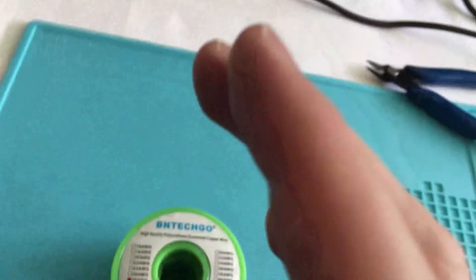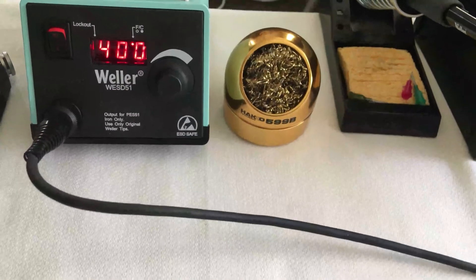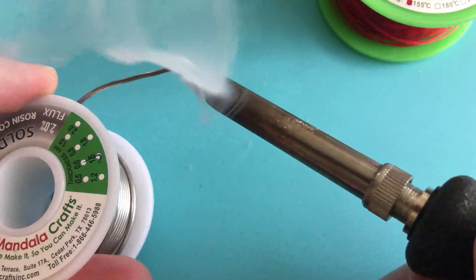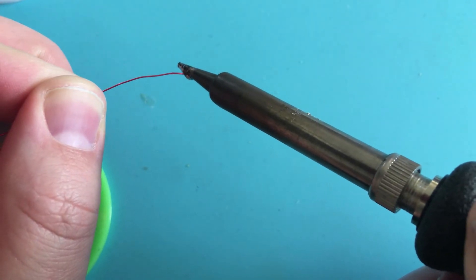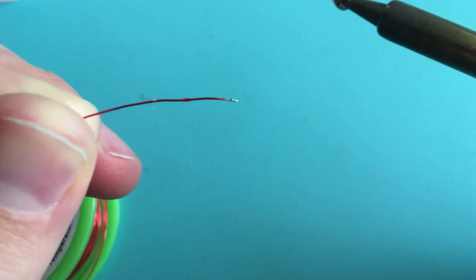For those of you that can't bother to learn anything and need the answer right away, here it is. 400 degrees Celsius is the magic temperature. I use 60-40 solder and I put a little bit of rosin flux on my lead. Insert it in — let's say a couple millimeters — one, two, pull it out. It is perfect.